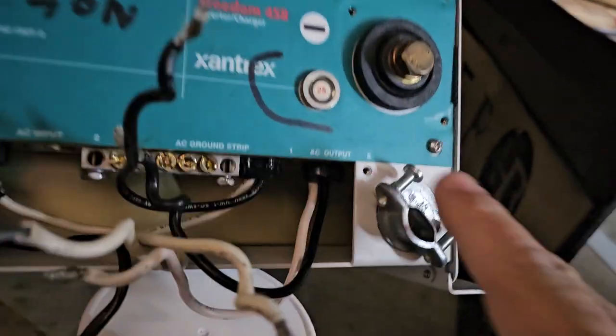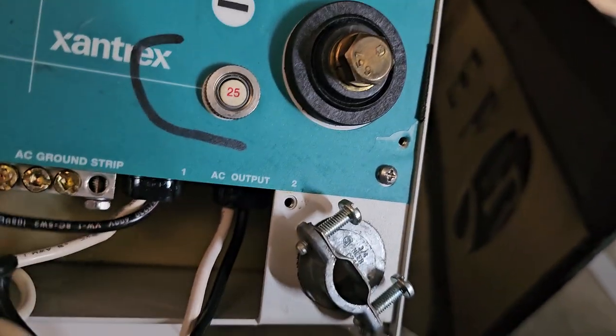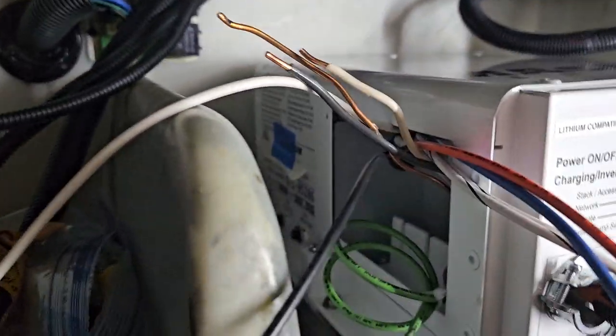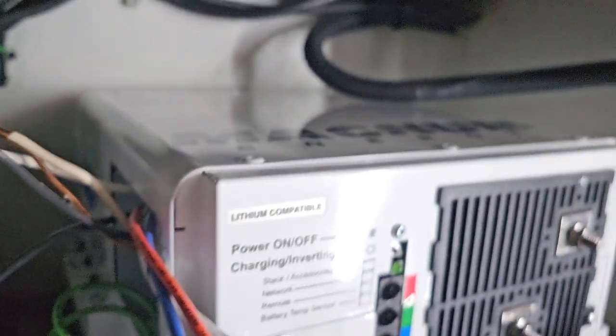AC in on this one, AC out — it's relatively easy. Remember, some of them you tie together on the outputs; this one's a little bit separate. I'm going to tie these wires together. They didn't send a terminal block with it — I usually have a block. I guess they're getting cheaper; you've got to ask them for the block now, it used to come included. The Xantrex never did have a block in them, but you can put one in if you want. I'm going to wire them up — AC in, two AC outs — basically just wire nuts, stranded wire on solid wire.